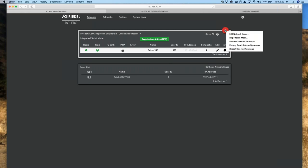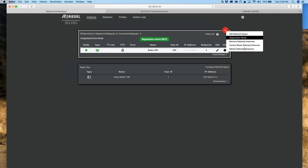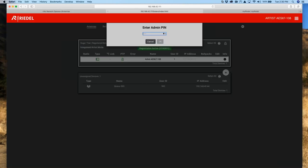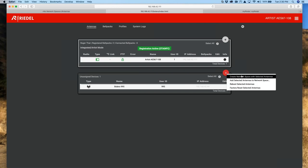Having switches that understand PTP does that. It's almost like having frame syncs in a video network, right? You're reclocking everything. Switches are helping to reclock signals to minimize PTP offset, to make sure that the timing is that much tighter and that much more precise by the time it gets to the antennas, and the antennas sample that network timing and turn it into DECT RF timing.